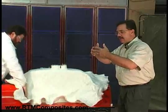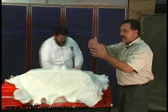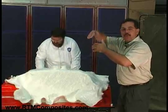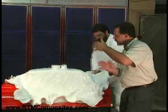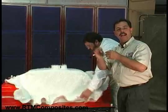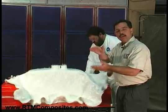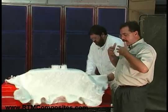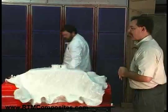We need a bit of resistance in the front. If we have glass at the front of the resin flow but it gets to a radius and the glass is pulled tight to one or the other side of the mold, the resin will go down and around where there's a gap between the glass and the mold surface. So we want that glass to fill up the mold, giving us resistance so we create a full wave front of resin flowing through. Let's let Don finish.